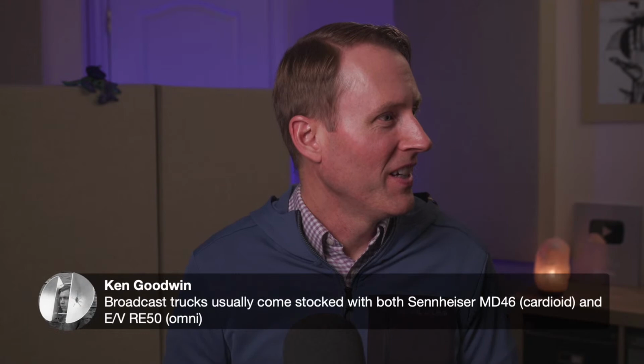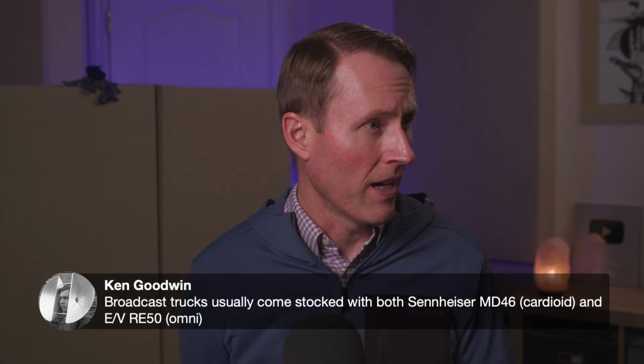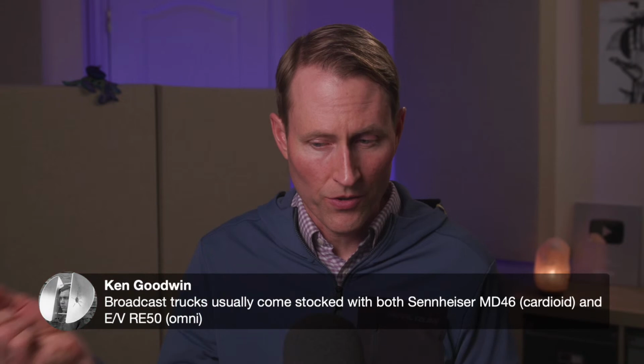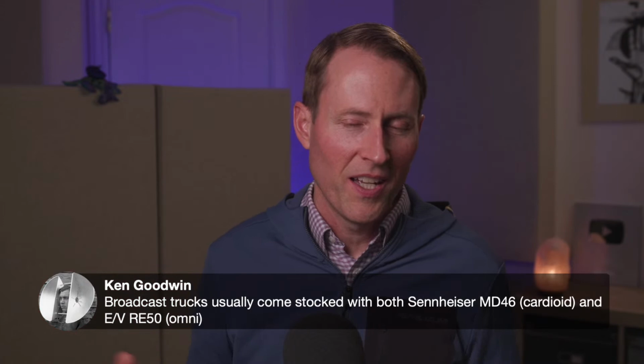Ken, broadcast trucks usually come stocked with both Sennheiser MD46 cardioid and Electro Voice RE50 Omnis. Interesting point. Yeah, I've used both of those. In fact, I really like the MD46, but again, it's one of those you do have to have it aimed as you're doing the interview. There's a lot of this going on with something like the Electro Voice RE50, which is an omnidirectional dynamic. You don't have to be so aggressive about pointing it back and forth as the two different people are talking. You can just basically hold it between you. And so there's a different way of working.